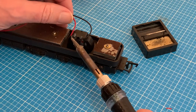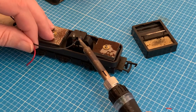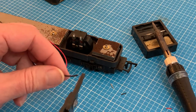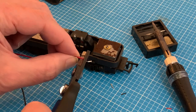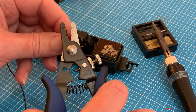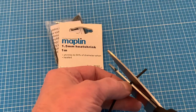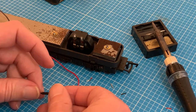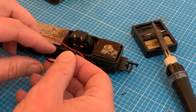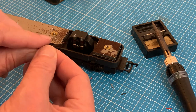With the insulation removed, I'm coating the ends with a little bit of solder, which will make the final joint quicker and easier to do. Putting the prepared chip to one side, I can unsolder the red and the black wires from the motor, just using the tip of the soldering iron. I'm going to leave the blob of solder on the contacts, but I'm going to snip off the ends of the wires and strip down the insulation to a nice shiny piece of wire, ready to join to the wires for the decoder. Those joints are going to need insulating, and the best thing for this is heat shrink — although you'll have to buy it from somewhere else since the sad closure of Maplin. Just cut a short length, enough to cover the exposed part of the joint, and slide it down the wire out of the way for now.